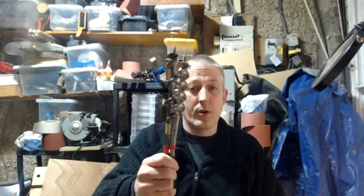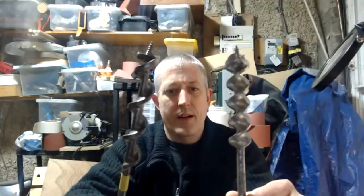So let's get into pretty much the standard augers. These are the two you're most likely to encounter: Jennings pattern and Irwin pattern. The Irwins have a solid core running up the center, so the Jennings have a double twist. Really the difference between these is, to me, academic — most of the jobs I do, it doesn't really matter. The Irwin is the later invention, and the idea is by having the solid core you have a stronger bit, more space for shavings to escape, so it's less likely to jam and clog in wet, pitchy wood or anything like that.